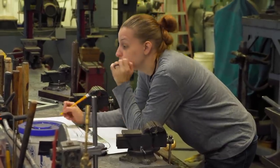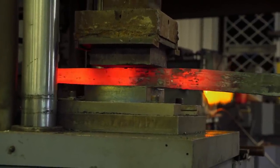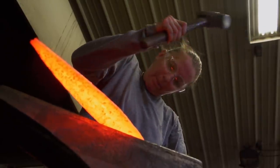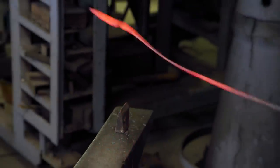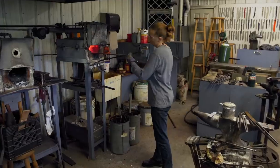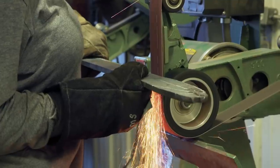It ended up taking me a lot longer to draw out my Damascus billet — I've spent two full days making the steel I need to even make this Pyrrha. Today I'm just nervous about getting this blade done. I need to get this thing shaped. I start to work in my swell, but as I continue to stretch my metal, I notice it is getting dangerously thin. I stick it back to straighten everything out, and I just watch it lean. It won't survive the quench. So two and a half days in, I'm starting over with a mono-steel. I grab my bar of 5160 and into the forge it goes. Having to start over halfway through day three sucks, but I'm going to push as hard as I can to get this thing done.